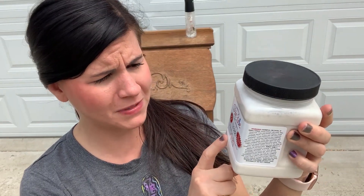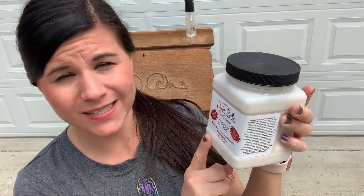Now the piece is clean and dry — you can already see it took some of the color out of the wood. It's ready for a new design, so we're going to put a clear coat of BOSS on it. BOSS stands for Blocks Odors, Stains, and Stops bleed-through. This is going to act as a primer, stopping oily tannins from coming through the wood and giving a really good base coat for the paint to adhere to.